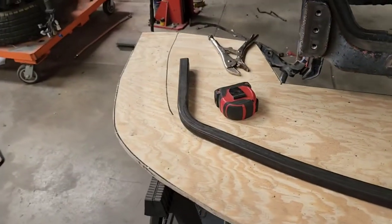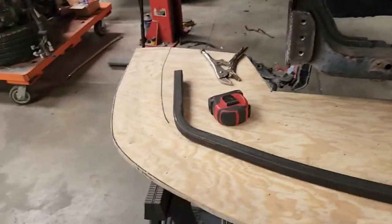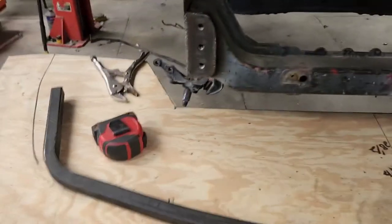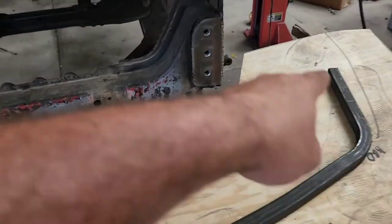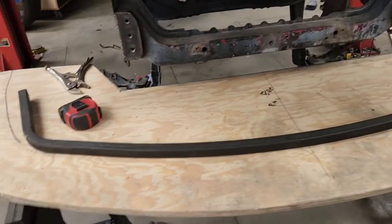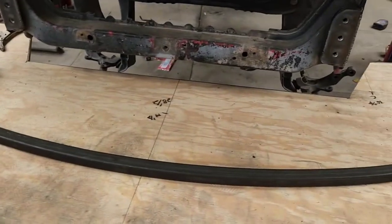After some adjustments on the bends there and there, we've got a piece that I feel fits fairly nicely, and it's going to fit nicely behind the bumper, which is sitting on the ground over there. But basically what's going to happen is we're going to have some mounts come off of here vertically, and then it's going to spider web itself outwards to brace to our tube here, which will have bolts coming through it. And then it'll all come off as one piece by undoing the 6 bolts, 3 on each side, and the whole splitter will come off of the car as one.